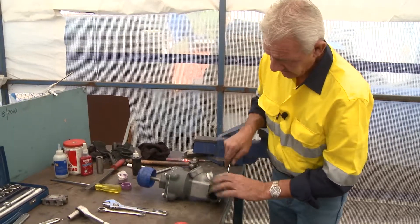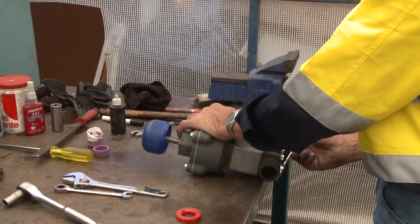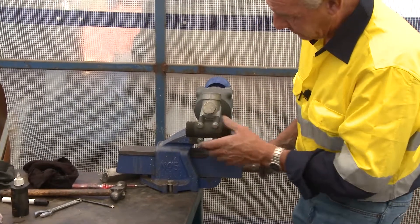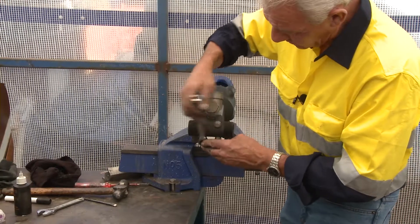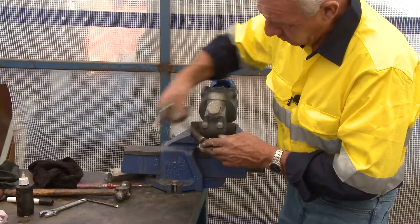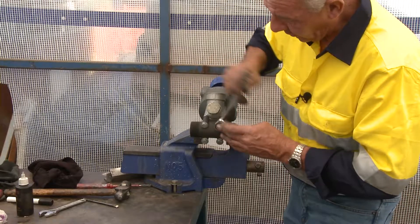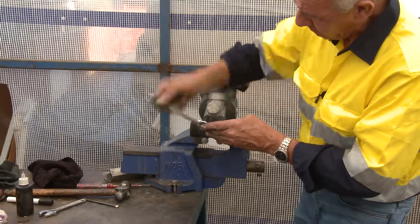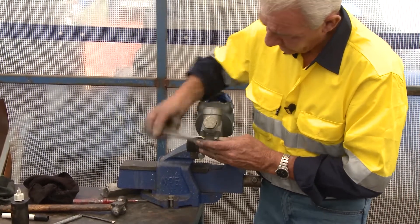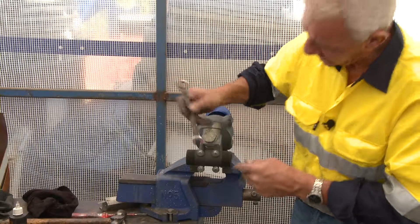These will be 9/16 — they are imperial, not metric on these. Hold it nice and still. If they're a bit tight, if you've got a vice available, by all means pinch it and hold it safely. But I'm simulating a broad cross-section here — a lot of you guys know that when you're on site, you don't have a vice. You can put your foot on this and hold it still, or grab the base of the body with a pair of Stilsons, hold the Stilsons with your foot, and undo it. You'll notice I'm using a ring spanner — you can use sockets, or if you've only got open-enders on site, you can use an open-ender.